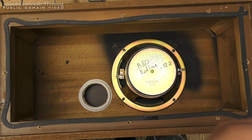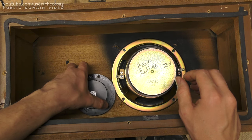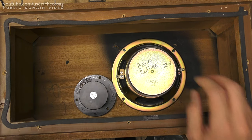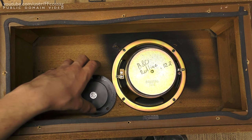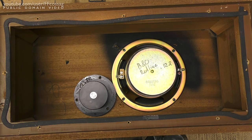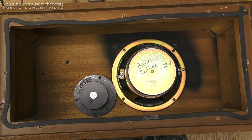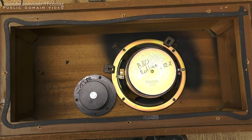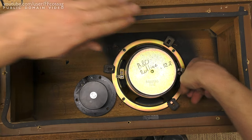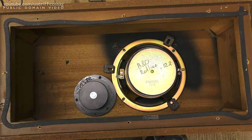Once you've got the woofer mounted, you actually need to mount the woofer first and then the tweeter, because the tweeter will actually overlap the woofer ever so slightly in order to be centred in the hole. I've just used a hand drill to drill three holes for the tweeter there. The original tweeter was mounted on the edge side of the cabinet — you'd have to rip the metal stripe off in order to get at them, which is very ugly. I also used the drill to move the holes for the woofer mounts, just to better optimize it for the three-piece mount we're doing. You can't really go too close to the edge because you have this ledge here which makes it rather impossible to actually get a screwdriver in there to tighten it down properly.